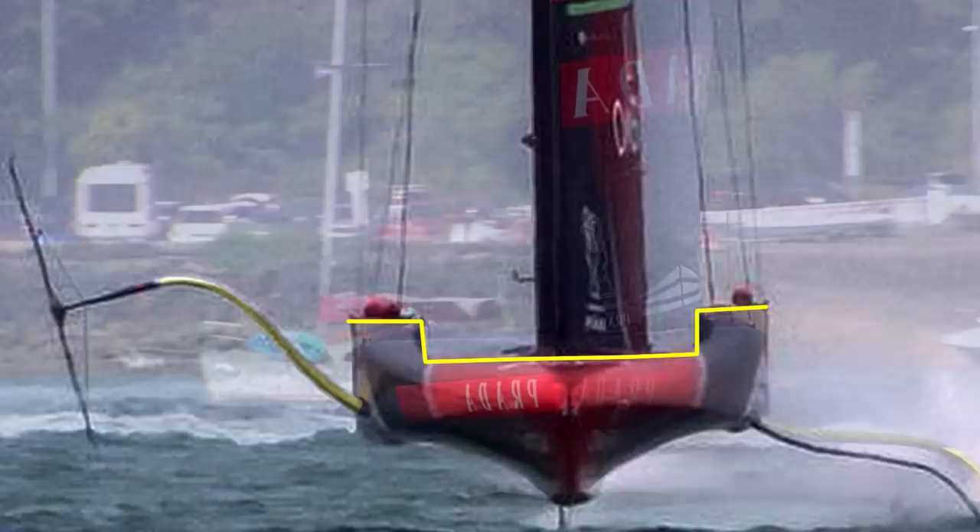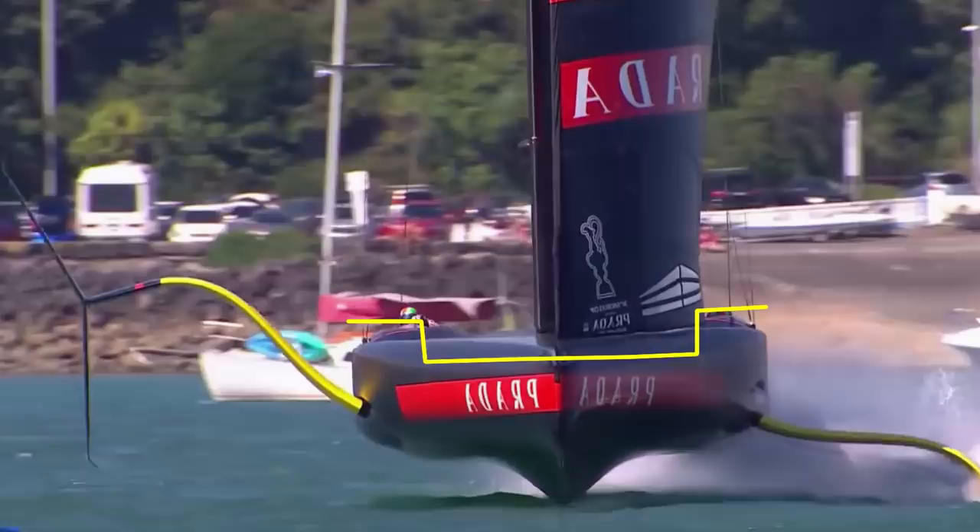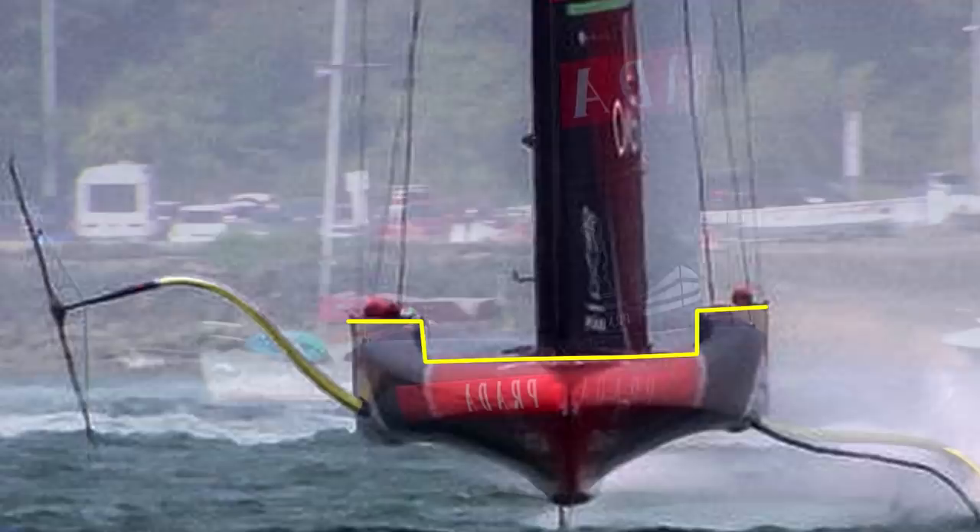The mast is set up on a pedestal rotating, with all the fairing and sail shape going down below the mast foot — that's extra sail area, extra power, all down low where you most want it. It gives them a hugely powerful righting moment — another 18 inches of effective mast length, but 18 inches down low in the power zone. It also allows them to drop the deck more and reduce frontal area. It's a hugely clever rules workaround from Emirates Team New Zealand, exploiting the rule about the mast rotation point. This also feeds into their boomless setup: if your mast rotation point is up about 18 inches above the foot of your sail, you don't want to put a boom slanted up onto a gooseneck on the mast.